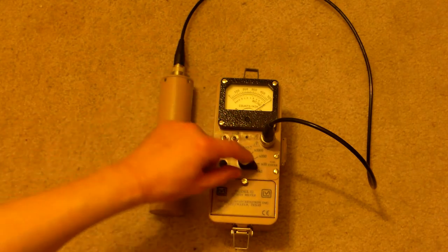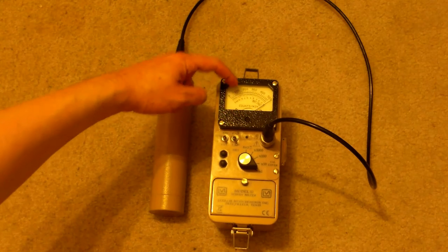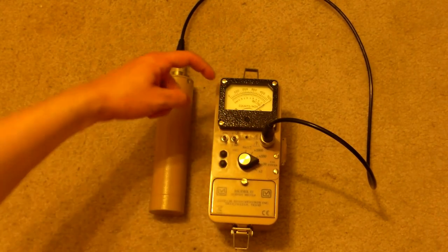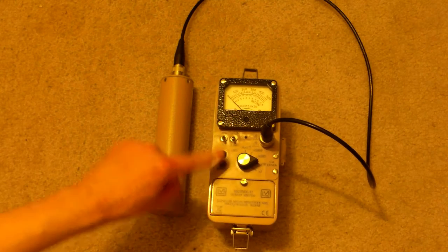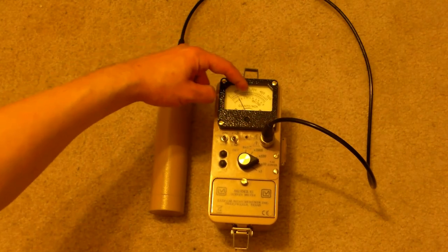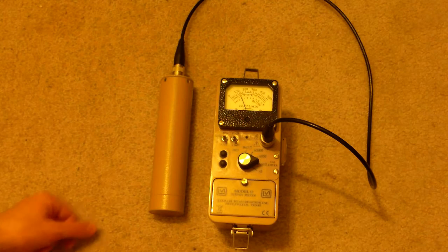For example, right this second, because we're in times one, the meter reads 0 to 100 counts, 200, 300, 400, 500 counts in 1 minute. And if we turn to times 10, we end up with, and let me hit the reset button, by the way, this zeroes the meter. And then it will build back up again. Very useful. And times 10, we are at 0, 1,000, 2,000, 3,000, 4,000, 5,000 counts per minute.